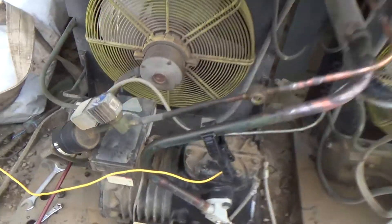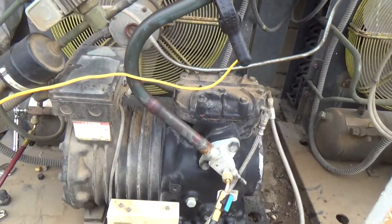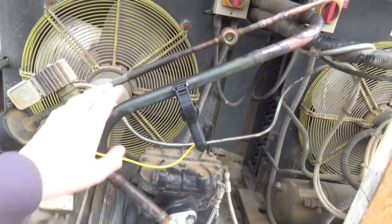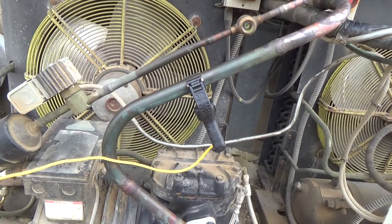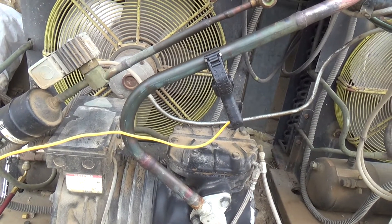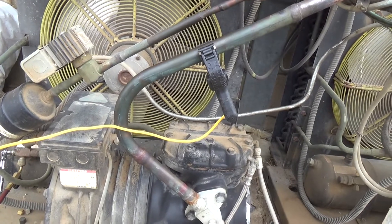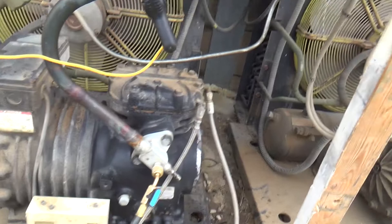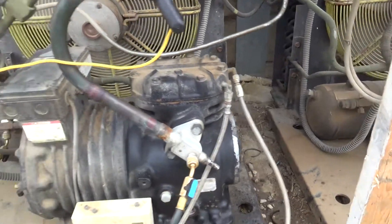I missed that shutting off because the phone rang, but it was running about 15 degrees superheat, although one of the valves is hunting a bit. But they're rusty old Sporlan ones, so I think we'll be changing them in the near future anyway. Oil level's come up a bit as well, which is good.